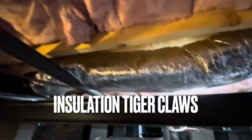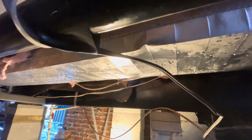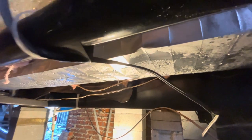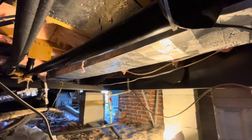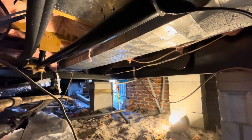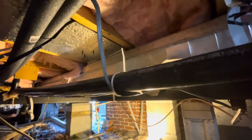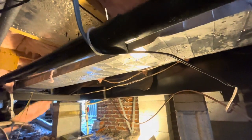Make sure I got them all in. We're still going to come back and wrap all these pipes. Look at the water condensation because they're exposed — they were inside the insulation, so the temperature in there pretty much stayed the same as what it was in the house. But now that we're taking that big underbelly out, it's raining. Paul hit the pipe and it started raining. You don't want that. So we're going to be wrapping them with insulation all the way around, building a box actually to put that in so that it's completely wrapped. Stick around to watch these videos, guys — they're coming.